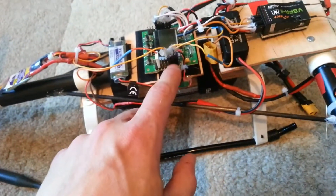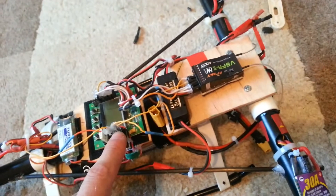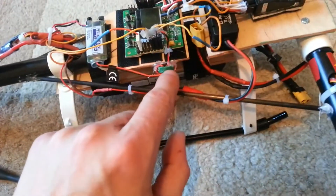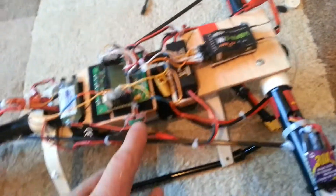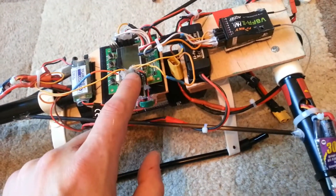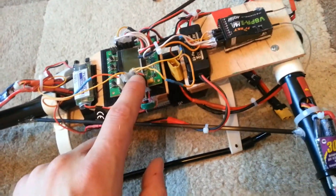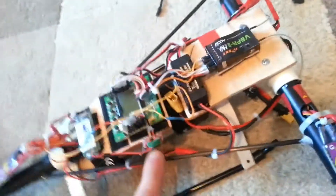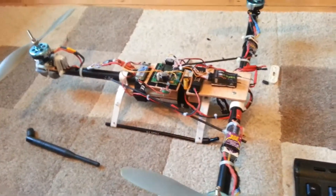What I've done on the pin is literally tinned it with the tiniest little bit of solder. This ferrite ring was also dragging on the same connection, so I tinned the connector on the board with the tiniest bit of solder, hot glued the actual wire into the connector so it's going nowhere, and then hot glued the ferrite ring to the board so it can't shake and drag the wire around. Seems to have done the trick.